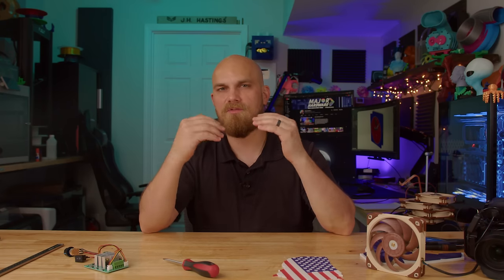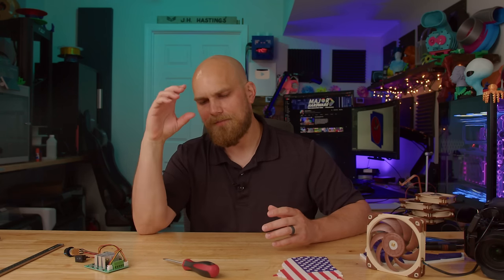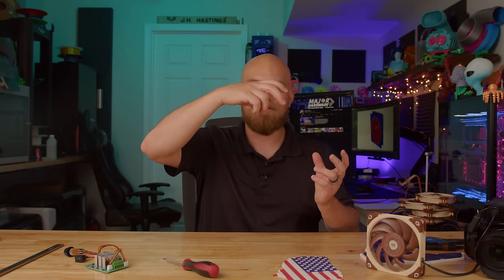Loading the ball bearing wasn't hard. It was a bit finicky as well. I wanted the front of the fan to be smooth, so I wanted the front smooth side of the cage to face outwards, which meant that I had to load the bearings from the backside, which was a bummer because the backside was closed out by the coil. So after I had them wrapped in a way that I thought would work, I had to gently remove the whole coil assembly from the frame.